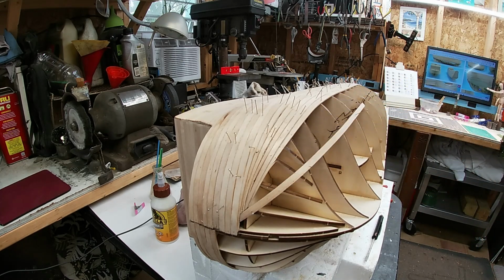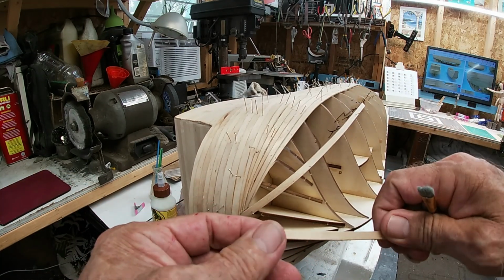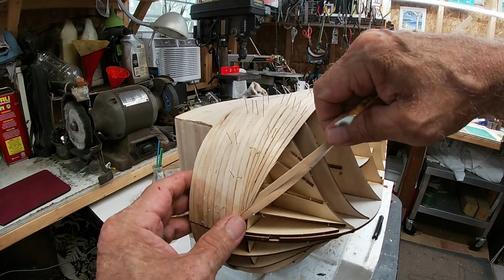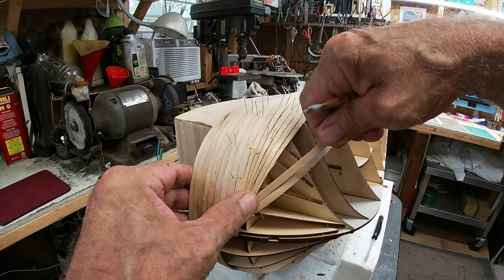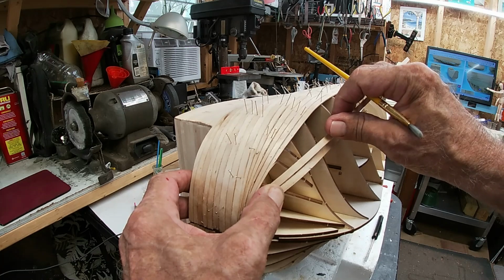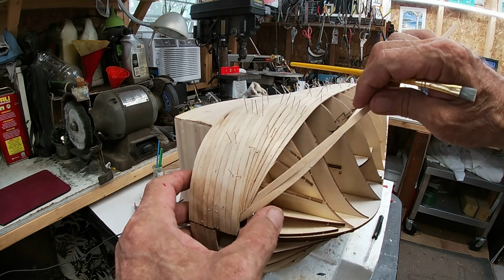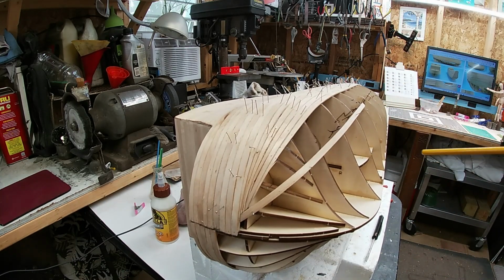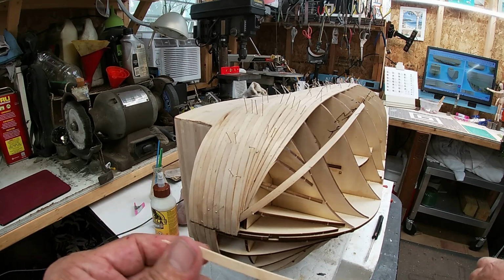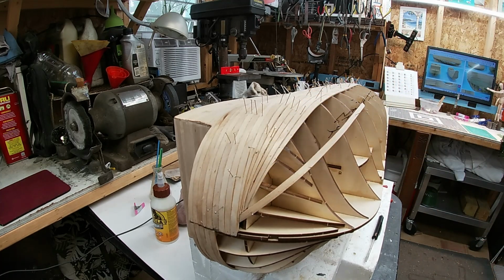and bent. And I've got one that I just pre-soaked. I haven't put the heat to it yet. And this will be the bottom one. It'll go up in there like that. And then there'll be another one here that's going to have that same kind of face cut to taper in, and then another one below it until we get to the 6 to fill up this opening here. So you can see that those were tough between the shaping of the taper and the bending to get that right.